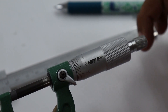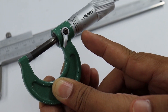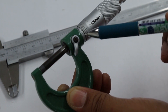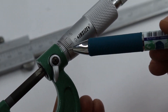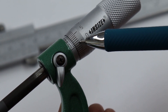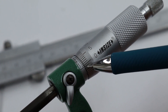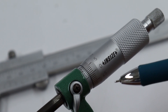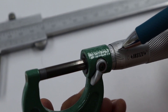Don't try to apply a hard force or overtighten the spindle. Lock the micrometer, then read the scale. Here you can see that the reference line and the zero line of the circular scale are not relatively coinciding — this means there is an offset value or zero reading. The reference line is below the zero line of the circular scale, so the zero reading is a negative value. Moreover, the reference line does not pass the first line of the circular scale yet, so the zero reading is less than 0.01 mm. Then we find the single line of the vernier scale that coincides with the circular scale.